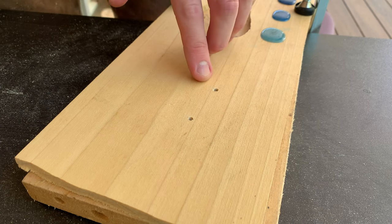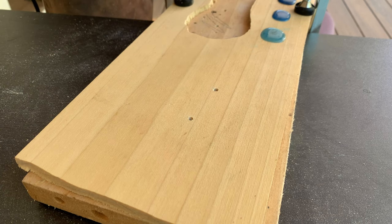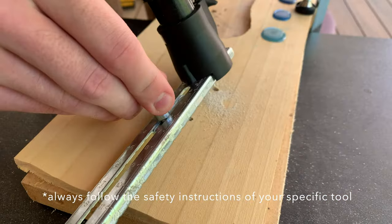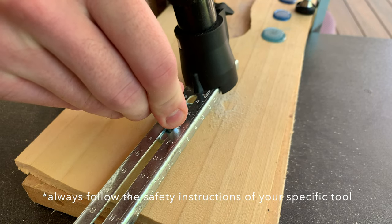Here I have a thin piece of wood, so I'll only need one pass. If you're working with thicker wood or harder material, do several passes while increasing depth each time. I drilled two eighth inch holes — one for the bit to start, since the 561 cuts from the sides so plunging it in isn't very effective, but also because it'll yield a cleaner cut. The other hole is for the attachment's pin to sit into. Use an RPM that's appropriate for your tool and material — I'm using 30,000 RPM. Seat the attachment and begin cutting, smooth and steady.